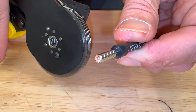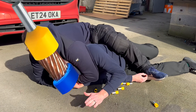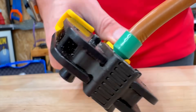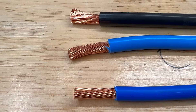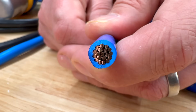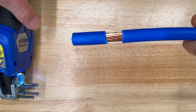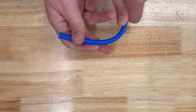One debated topic in electrical wiring is when ferrules should or shouldn't be used. The correct answer depends largely on your location and the standard wiring practices in that region. To fully understand when ferrules are appropriate, it's essential to first grasp the basics of conductor construction. A class 1 conductor consists of a single solid strand of copper. Class 2 conductors are made up of multiple strands with a minimum of 7 strands, often more — some class 2 conductors use 19 strands, and increasing the number of strands enhances flexibility. These are often referred to as stranded conductors.